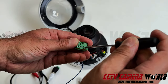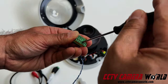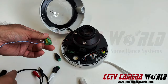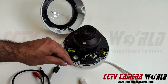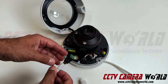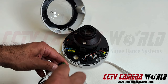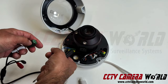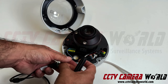I think I've got a good wire connection there. I'll tug on it — the wire's not coming loose. This goes into the camera. Of course your wire should be longer; mine is short just for demonstration purposes. Now you need to terminate it into this connection. Remember: positive is going to be my striped wire and solid is my negative side. Striped is positive, not striped is negative.